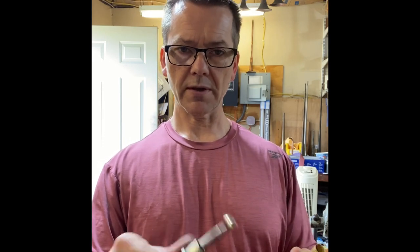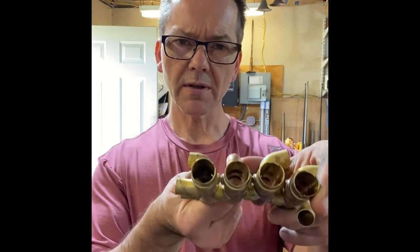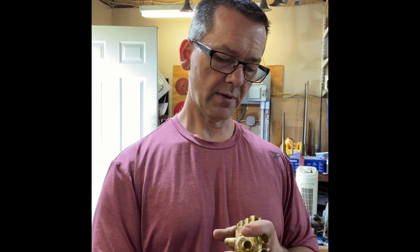So this is what I'm doing. I reach in, there's a guard that I use to protect the casing itself, and I'm gonna reach in and place this half round cutter on the inside of each knuckle. And I'm gonna cut that away by hand. You get used to doing this after a while. Casings are very sharp on the top and on the bottom. Over time, you get used to what you can grab and what you shouldn't grab.